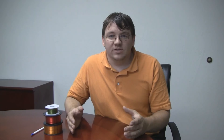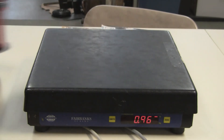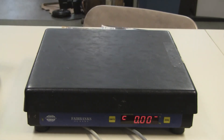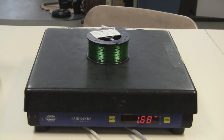You can also get a lot of information from the wire gauge if you look it up in a chart. It'll give you things like weight and actual diameter of the conductor. For example, 4-ought wire weighs 640 pounds per thousand feet, while 40 gauge wire is less than 0.03 pounds per thousand feet. You can see why selling by weight is more accurate than trying to roll it out by length.